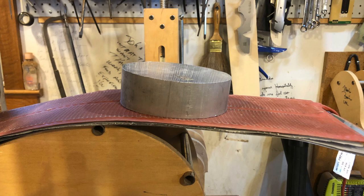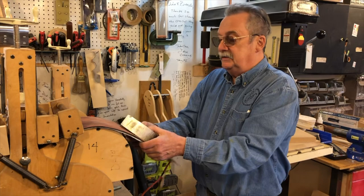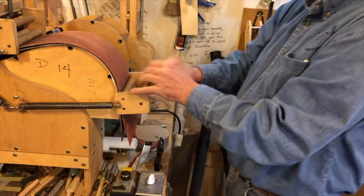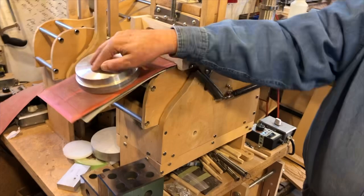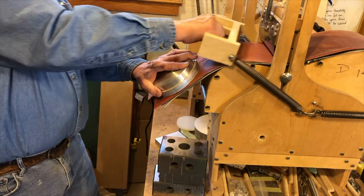This has been in the bender, the temperature is coming up — I'm at 220 degrees. You can see how that weight's letting that work down. When I go to move this down, I just don't slam it; you want to take your time with it. I'm at 234, 235 degrees. I'm just going to give the waist a couple of flicks. I'm at 240 — you can see that it's moving pretty good. I'm just going to help bend this a little bit, and I can feel it wants to go. Total time took me about three and a half, four minutes to get up to temperature. I did check to make sure everything was damp. I can feel it's bending wonderfully — that's all bent.